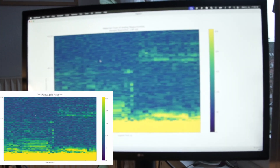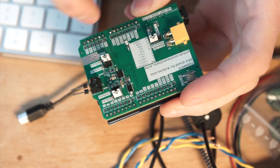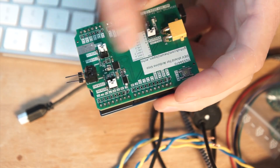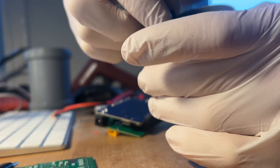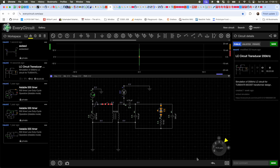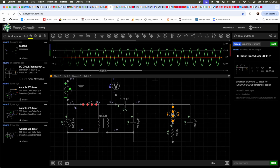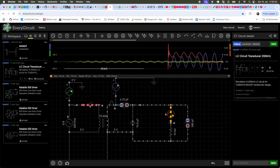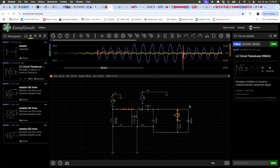In air the results were quite underwhelming, but I decided to test it in water anyway. In the test I used the original TAS 4470 setup I built, but modified it with a 1:6 transformer between the TAS and the 200kHz transducer and its little matching capacitors. The return signal is captured before the transformer, because the input of the TAS seems to be saturated when the return is grabbed directly at the transducer, but I think I have to read more about that in the datasheet. A little simulation in LTspice helped me to determine the capacitor values and understand what's actually going on between the transducer and the transformer.